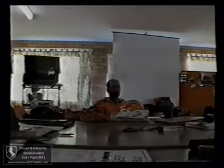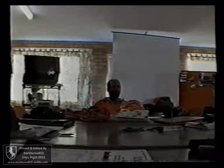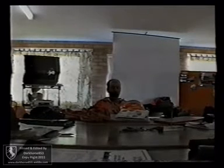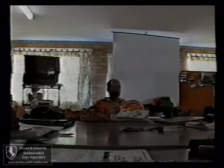Okay, Steve, before we go up, I've got one problem. It's not getting up the roof that's my problem, it's getting back on the ladder. Well, we'll talk about that, because that is not an uncommon problem. I can get up there, I can do the job, okay? It's getting down that first couple of steps on the ladder. Once I'm on the ladder securely, I'm right. That comes down to securing ladders and how we put the ladders up there. We do have a tendency to put the top rung of the ladder at the gutter, and we should have about 2 or 3 rungs above the gutter so that you can put your hand actually onto the ladder. I know how to do it, I've got a fear of getting that close to the edge.